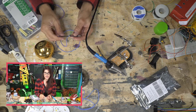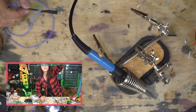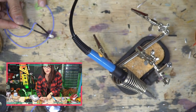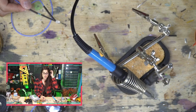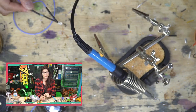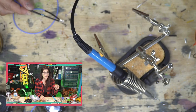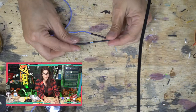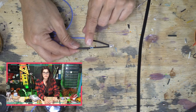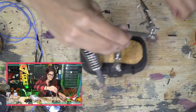So with this resistor kind of peekabooing right here, it's another cue because I'm using all these ridiculous colored wires. But because these are going in the Arduino, we're going to transition to a DuPont connector, so those will be correctly colored and I'll know which is which. In case I'm looking at it topside, that's another indicator that this is the positive line, because they're both blue, which you shouldn't do. Do as I say, not as I do.